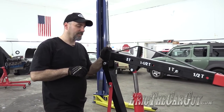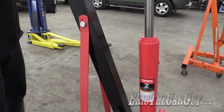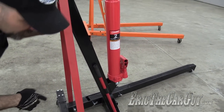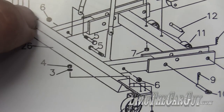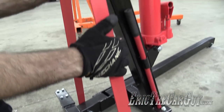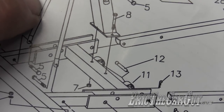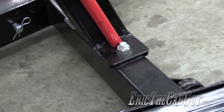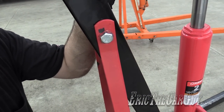A couple of things about the assembly of the SunX. It came disassembled and I ran into a couple of issues — mainly the instructions. They're all words, not many pictures. The instructions show to take the braces and put them on the inside edge, but if you do that they get warped and in a bind, so you have to go on the outside. Also, it says to put the bolts going down through this way, but once you fold the legs up, the bolts will contact the ground before the casters do — so you have to spin them around and bring them up the other way. Lastly, just tightening the bolts caused the paint to crack and come off.